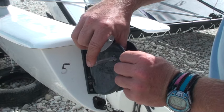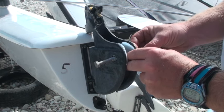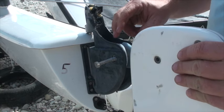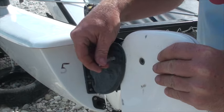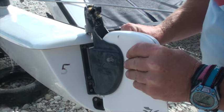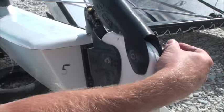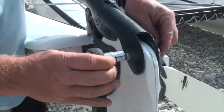To remove any movement between the rudder blade and the stock we're going to use some plastic shims. This can be quite fiddly to do on your own, so what we're going to do is just hold the shims in place using two bolts, putting them shallowly into the holes. We're then going to take the rudder blade and push it in making sure the shims don't fall out, withdrawing the bolts slightly to allow the blade into position. We're then going to put the top part of the stock back on and tighten all the bolts up — tight enough so that we're not restricting the rudder's up and down movement but reducing any play in the system.